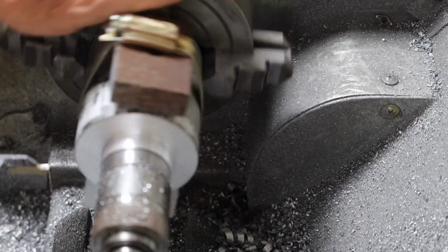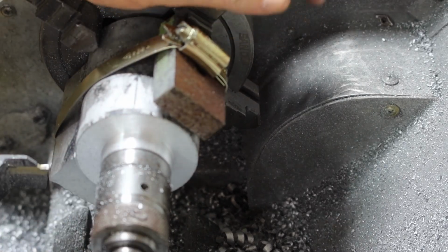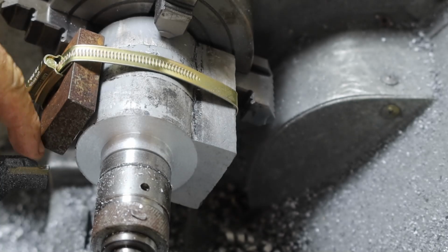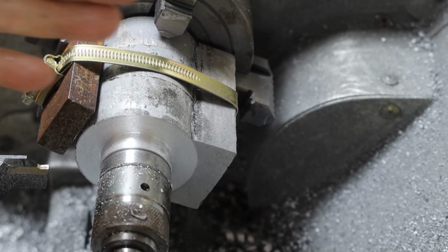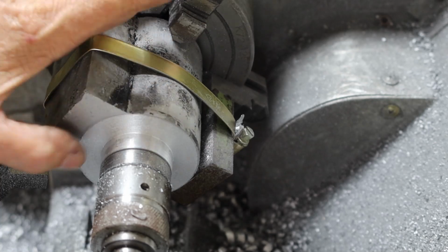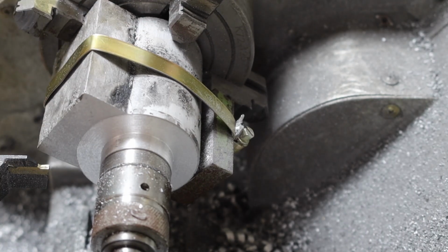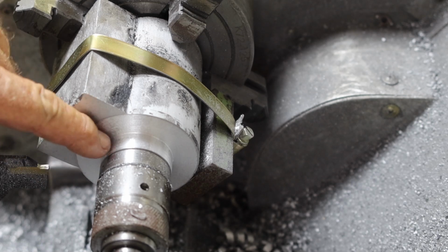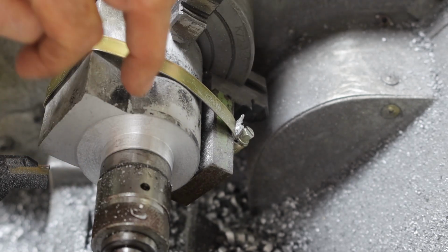Alrighty, so what I did was I got out the gate hinge live centre that I made a long time ago just for things like this. Fitted up the 3mm grooving tool, and I've been plunging in there about 2mm at a time to carve that off. Now I'll change this battery for starters, because I should have done it before I turned it on, and then I'll put a turning tool back in. I'll turn off the bit that's left and face that off one more time.